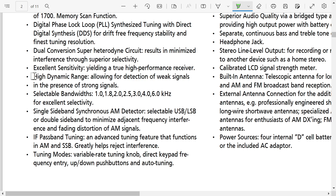One thing that might help is they mention high dynamic range — that's interesting because it could make a difference. Dynamic range is the capability of your radio to cope with receiving a weak signal right next to a very strong one. Usually a strong signal stresses the circuits and can desensitize or raise the noise level. If the dynamic range is better here, it could give it an edge over Tecsun receivers.